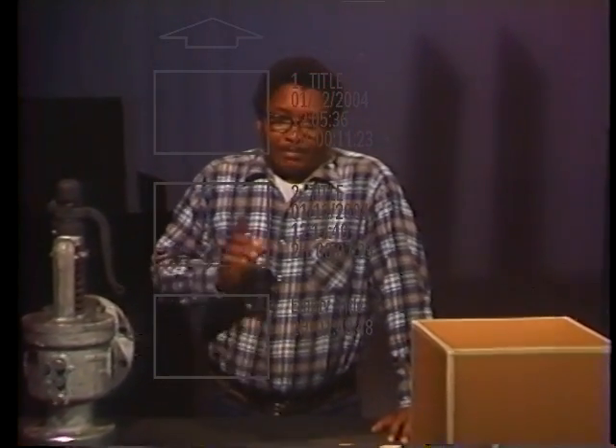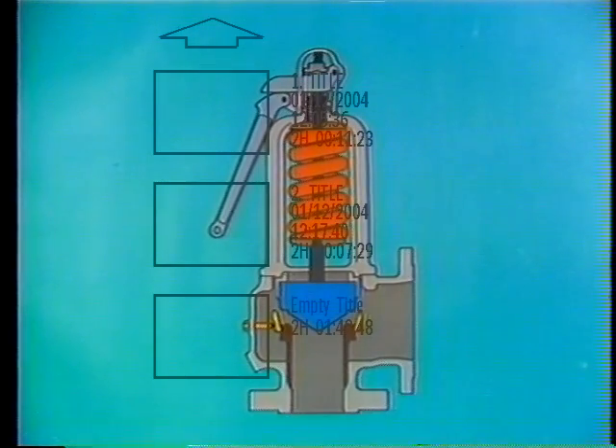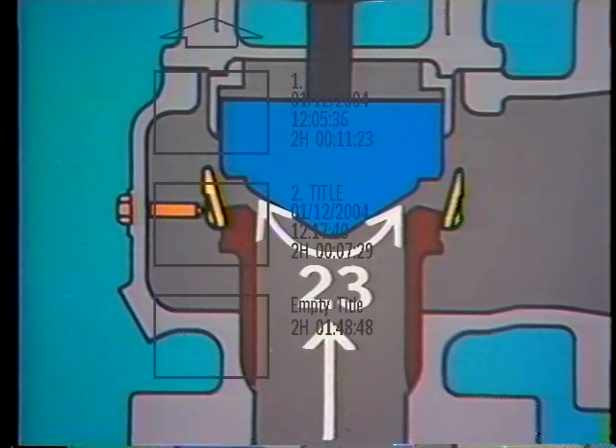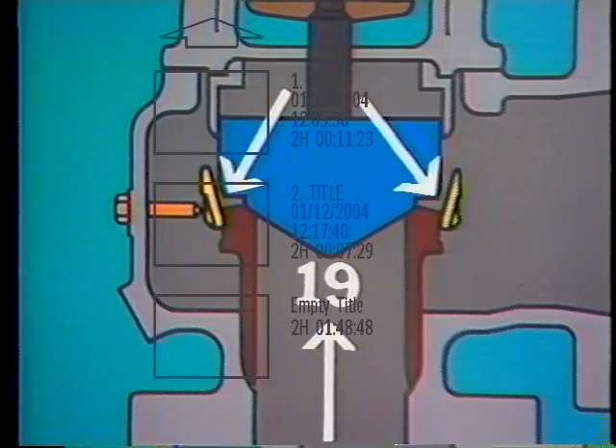So now we know there's a major difference between the way a relief valve opens and the way a safety valve opens. What about a difference in the way they close? Here's our safety valve, still in its fully open position. System pressure begins to decrease, and along with it, the velocity of the steam. Spring tension begins to regain the advantage, pushing the disc downward. Only when system pressure drops below the set point of the valve does the valve snap shut, to abruptly cut off the flow of steam, thereby minimizing steam cutting. A small cushion of steam trapped in the huddling chamber prevents the disc and seat from slamming together hard enough to be damaged.